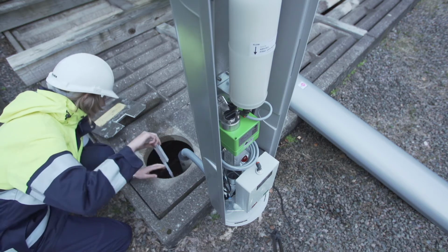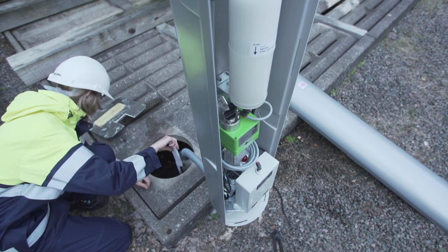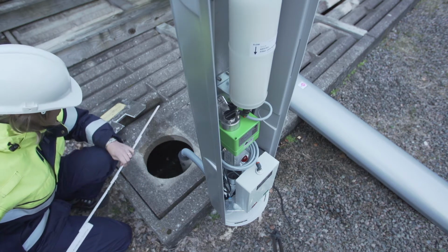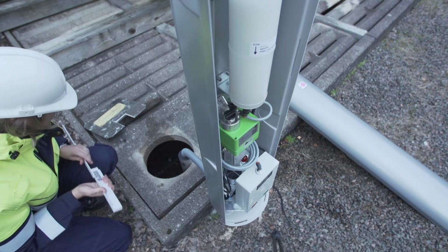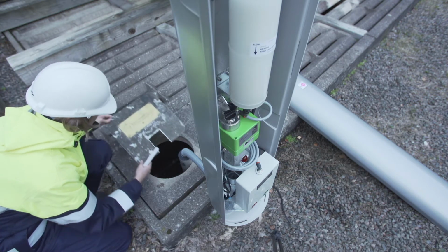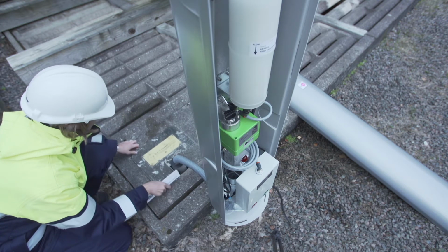Water level. The SIPP node normally starts a discharge when the water level is about 200 millimeters. If the level is higher, that is an indication that should be noted. The most common reason for the SIPP node not to pump out water is the water quality.